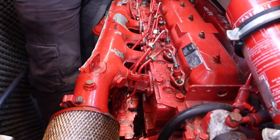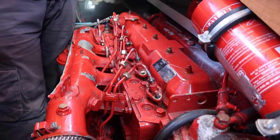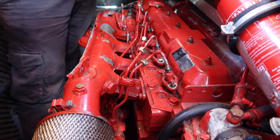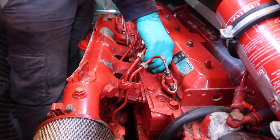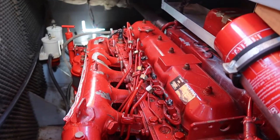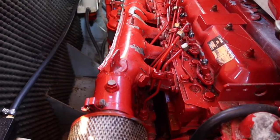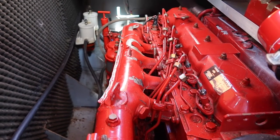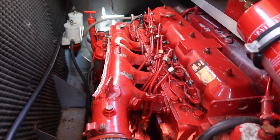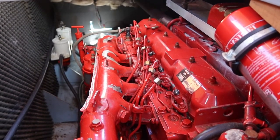When you have a rainy day, it's an excellent time to do some diesel work. Two ways other than sailing to make a boat work: one is the sails and one is this big red diesel. So we have to do some diesel maintenance to make sure she's reliable. The diesel starts and runs - I've run it every couple of days, turn it on, let it idle to warm up, then run it full out for a few minutes, then let it cool down and shut it down. But it's not really good for a diesel to run a lot on low load.